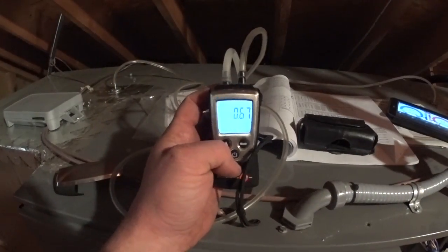I don't have anything to compare the static to, but luckily it is 75 degrees inside the house, so the iManifold will be able to calculate estimated airflow fairly easily for a while as the system balances out before we hit 69.8 degrees or whatever the cutoff is. I'm going to check static and then fire up the AC and go from there.